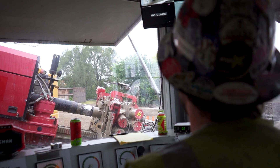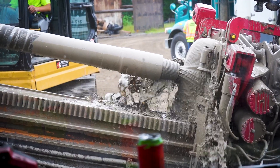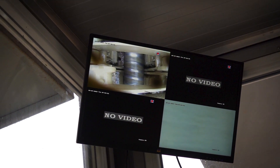At that distance, the chance of us having drilling fluid come to the surface where we don't want it is slim. We always maintain and monitor just in case we have an issue like that, but it reduces the chance of us putting any type of contaminants into that river.